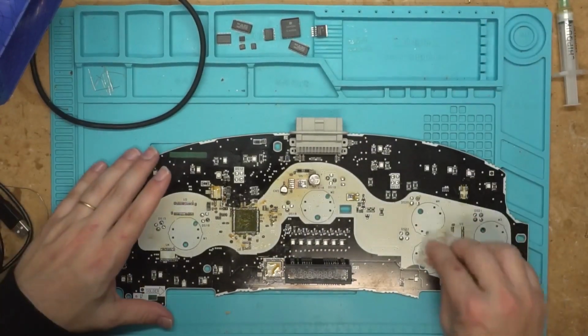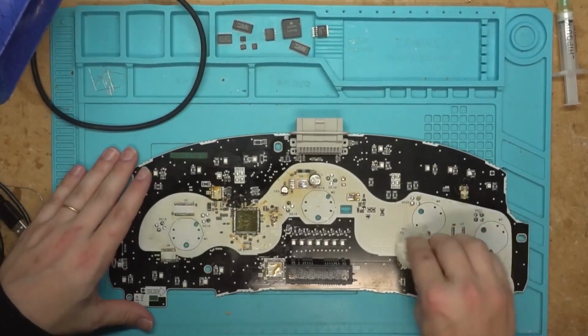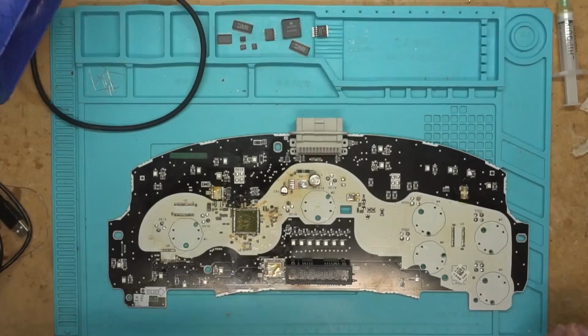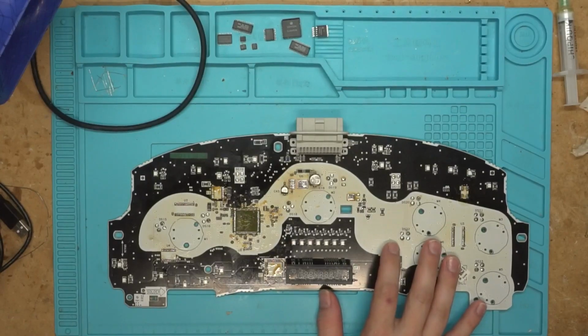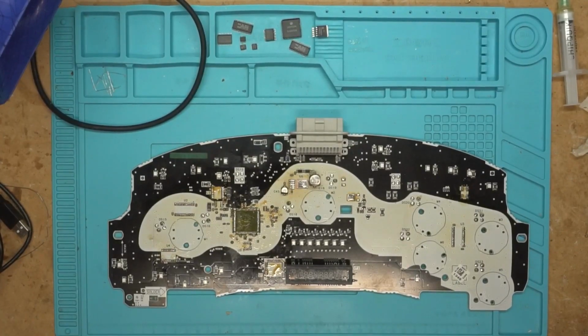I definitely burned up the dust, because this board's been sitting for so long. I could smell the smoke from the dust of it. But yeah, it didn't really discolor the board here, so I'm happy with this hot air station. It really worked great. It gave good consistent heat. I hate this white solder mask too because it really doesn't lie. It tells on you. It tells everybody when you overheated the circuit board soldering on it. Green and black are a whole lot more forgiving. People don't see that you overheated it nearly as much as they do with white.